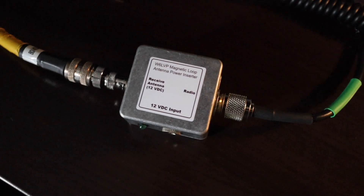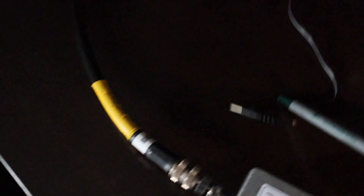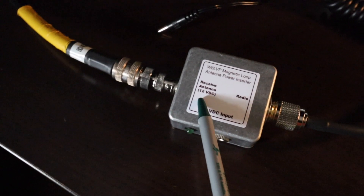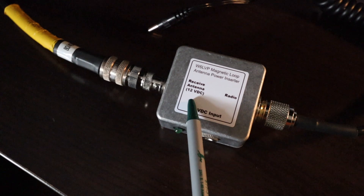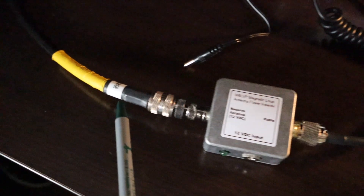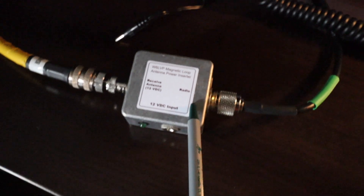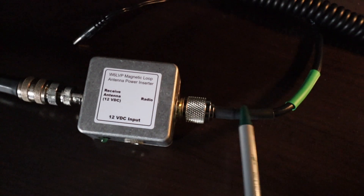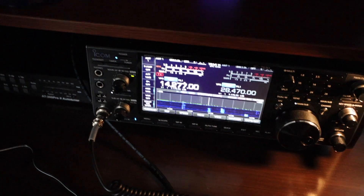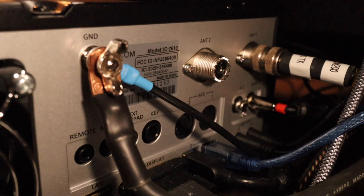Make sure you get the right connections because there is 12 volt DC going through the coax. I also purchased some BNC to PL-259 adapters, and I bought a Tiki torch — the Tiki brand. I'm going to put a PVC pipe down in there and use the thumb screw tensioner to keep it in place, so it's going to be a portable and temporary installation. This is the antenna power inserter. We're inside the radio shack right now. The 12 volt DC power is going to be connected here, and this connection is going out to my window pass-through to be connected to the outside loop.